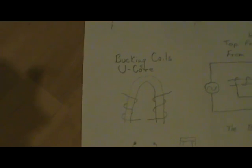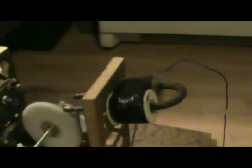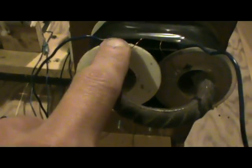And now these coils that are on my wheel here are just like this, right? They're wound exactly opposite. When I wound these coils, this one goes in this hole right here, that's the start, and it goes this way. And when it ends on the other side, it comes out going that way. And this one is the opposite. It starts this way and it ends that way. So those coils are wound in opposite directions, and that's the secret to tapping what's going on here.